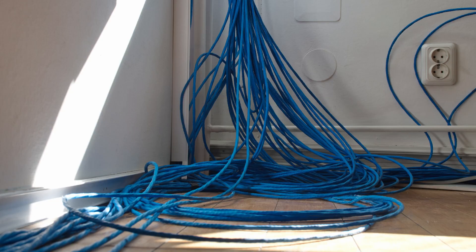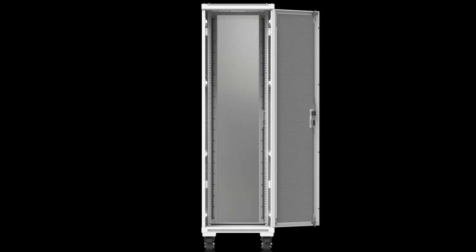Since we have all these cables coming into a central location and quite a few devices that the cables are going to be plugged into, we're going to need to organize. We don't want gateways and switches sitting on a shelf or on the floor, and that means we'll need a network rack. A network rack is a standardized enclosure for housing rack-mountable equipment. Pretty much any rack-mountable equipment will be about 19 inches wide and fit perfectly into one or more rack units. Each rack unit is about 1.75 inches high, and some equipment fits into 1U, 2U, or more. This lets us calculate exactly how tall our rack needs to be.